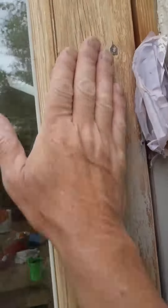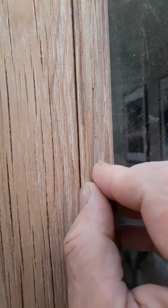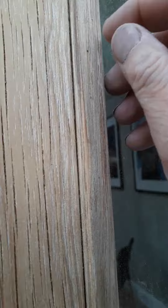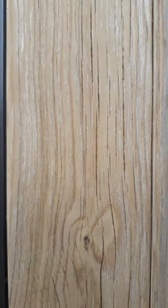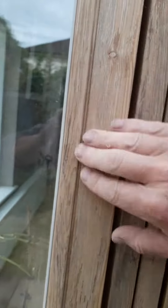Just sanding back timber here, and you can see we've got to a smooth, smooth substrate. Then we go into the grooves with a little bit of light. Timber has one or two little repairs needed, but we'll cut that there and fill it — so one or two little divots need attention. Sand it back and now we're ready.